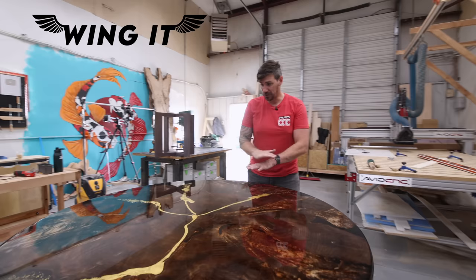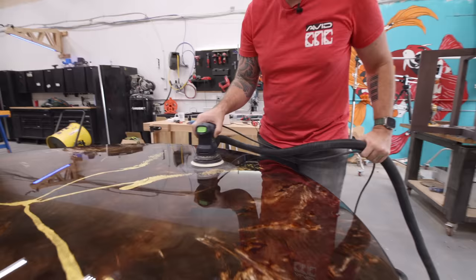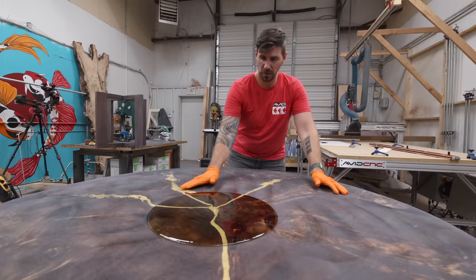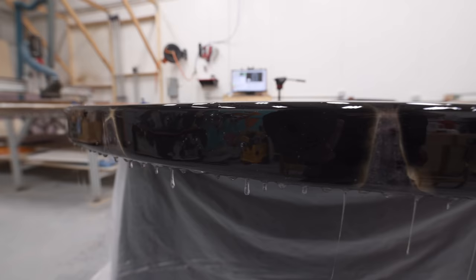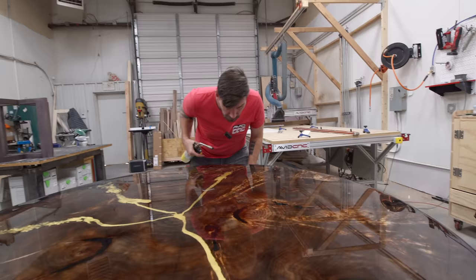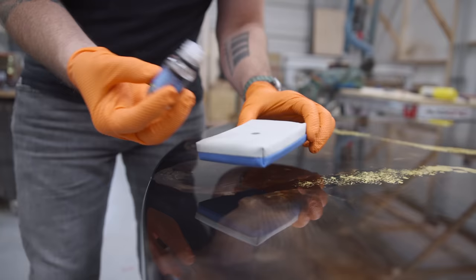This should be my last flood coat and I can finally finish this table. Thankfully that little guy wasn't fully embedded so I didn't have to scrape off too much. The whole table gets a light sanding with 320 grit to prep for the final flood coat, which I applied just like the first. This time I spent four hours just monitoring the table as the epoxy cured to make sure no more gnats made their way in. About an hour in, I'm coming out every 30 minutes, popping bubbles and removing any hairs or dust — this is why I should be wearing a hair net.